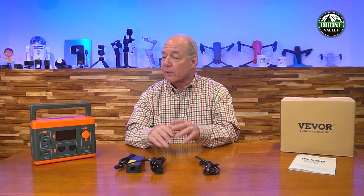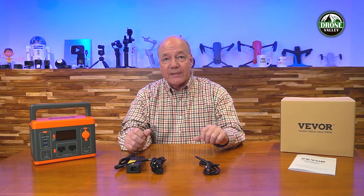You can even charge it with a portable solar panel when you're out in the field. That's really handy — you can find a small solar panel, maybe 100 watts, set it up outside your tent, plug it into the front of the unit, and convert that sunlight to electrons to charge the unit. One hidden way to charge it is through the USB-C connection on the front. This unit has a bi-directional USB-C port that delivers 100 watts of external power, so if you combine the AC charging unit with the USB-C charging you can charge the unit in about half the time.